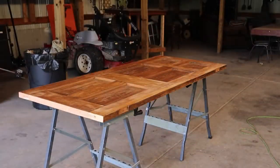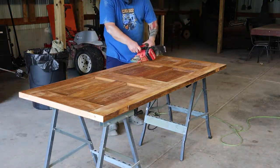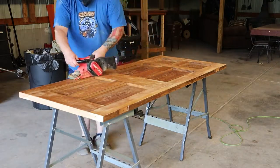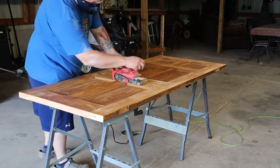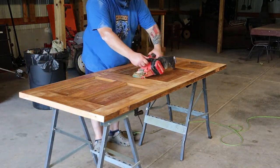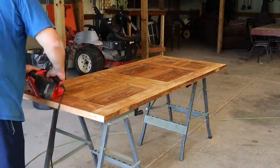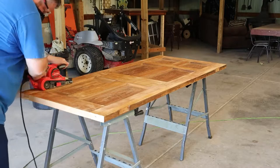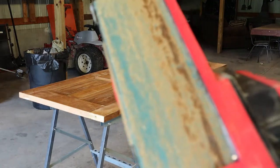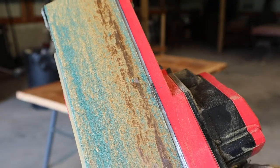The next step: I took a belt sander and did a nice rough sanding with some heavy grit sandpaper — I don't remember the exact grit, maybe 80. You can see here when I show the belt sander that there's still some finish sticking to that sandpaper, so a second coat of the Goof Off probably would have been good. After that I used an orbital sander.